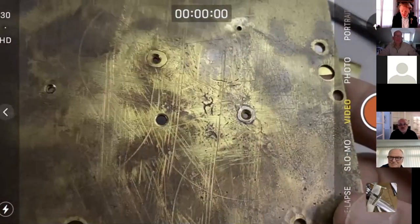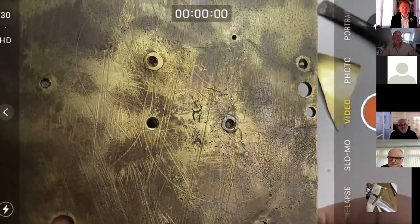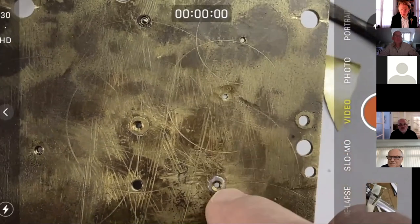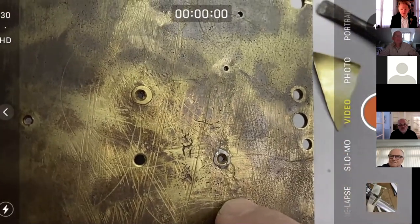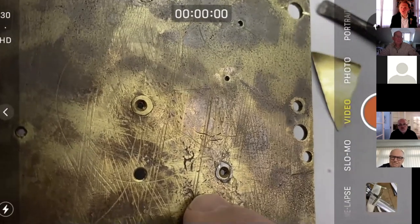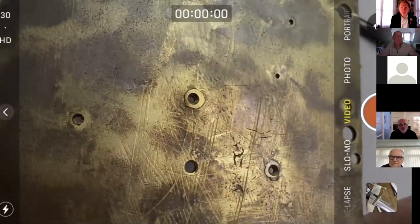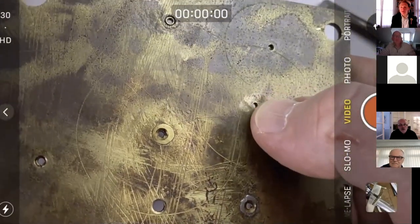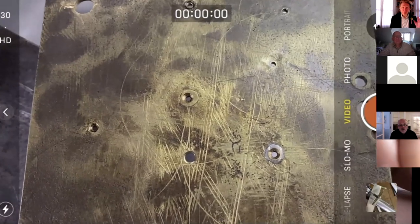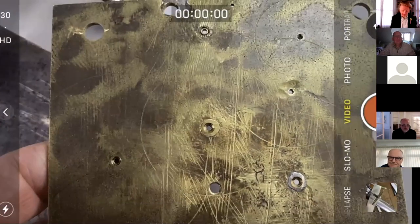Let's come back to this plate here with this soft soldered bush in it. And let's kick that about a bit. This has got depthing marks on it, as a lot of clocks have, but they don't look to me to be manufacturer's depthing marks. Interesting that the plate has got these kind of cracks in it and things. 200 years old, non-homogeneous material, a bush here that's been riveted in, as I said, and one that's been hammered up here. So all cool stuff to discuss. Those things, as I said many times, don't bother me one bit. As long as they're sound, they're not going to damage the clock. They're not going to damage the person that's winding it or running it.